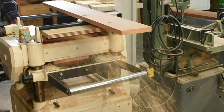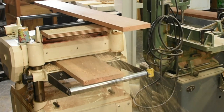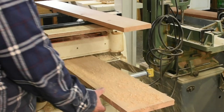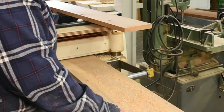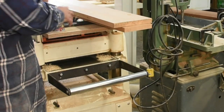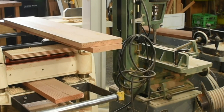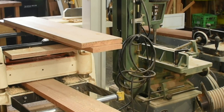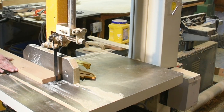I've milled up more lumber than I need for the board because I want different colors of grain in the wood. This will be the light material, and I've looked for open grain and closed grain so when you look at the top of the board you'll see different types of grain. We'll mix them all up in a box and put them throughout the board. You can see where the growth rings are quite definite — we have some tight and some loose grain.